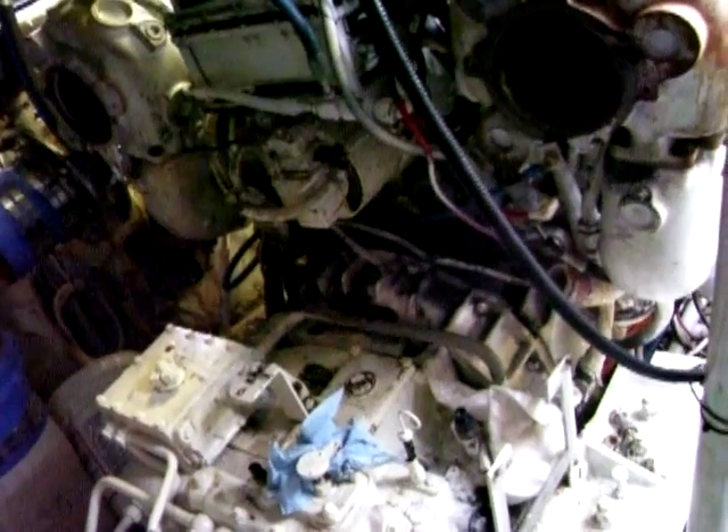Rear each engine, you've got a kilo-pack generator — I don't know the kilowatt output of it. What we've had to do to replace the coupling between the engine and transmission is to raise the rear of the engine. We've had to uncouple the propeller shaft, which I'm pointing at down here. All the bolts were pretty seized up with rust. We've had to unbolt all these mounts on the side.